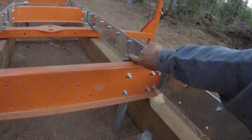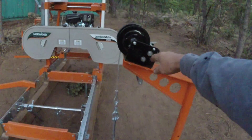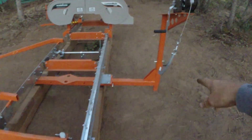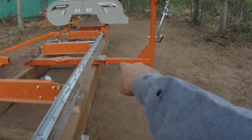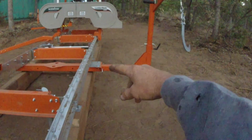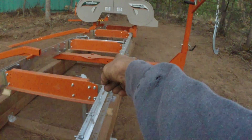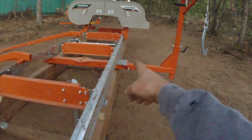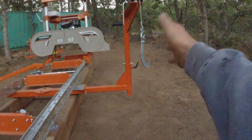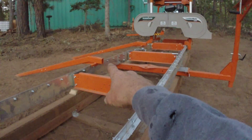And then after you've milled your beam into a square, turn it around and it rests right up against there — so you can mill something very, very thin. That's not even the width of my finger. And then this also swivels out of the way. It's also at its furthest point out. That little keeper right there — there's another hole over there. So when you're loading a log or flipping a log, you'll take that keeper out and push this whole assembly in until that hole lines up with that one. You'll put the pin in, it moves the whole thing in, but you don't have to take it all the way out. You have clearance with it swung out of the way like that — clearance to leave that there and still run your mill right past it. You do have to take the feet off of the legs.